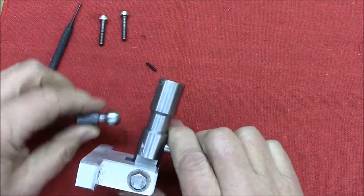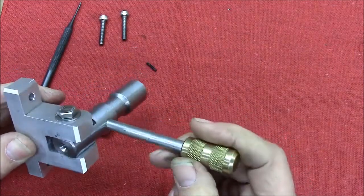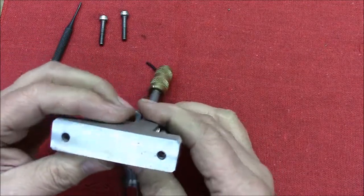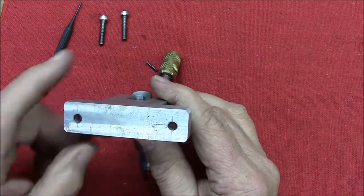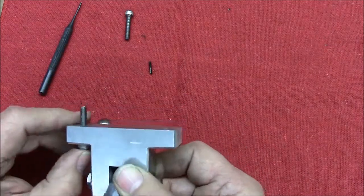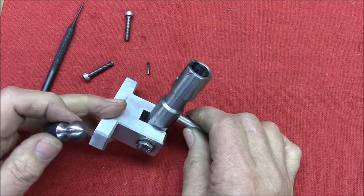It's just a piece of cold rolled steel with a brass knob for bling. This is what the base looks like, held in with a nylock screw. There are two holes I had to drill in the face of the lathe apron to accept this, and I tapped them — I think 10-24 — going in about that far. Let me take this back over, set it up, attach it, and I'll bring you back for a demo.